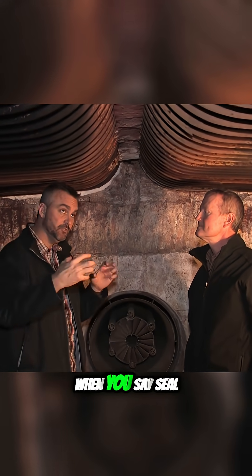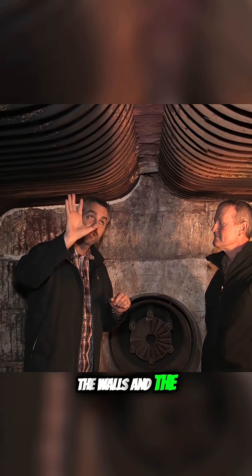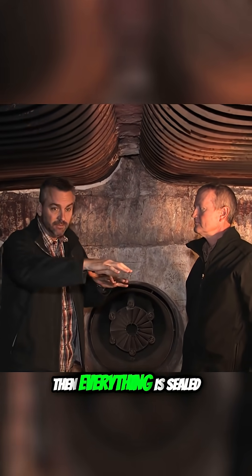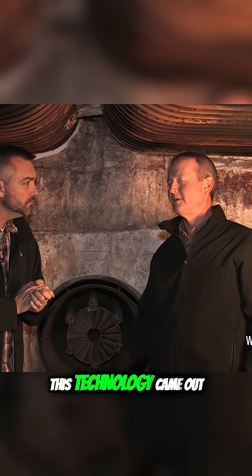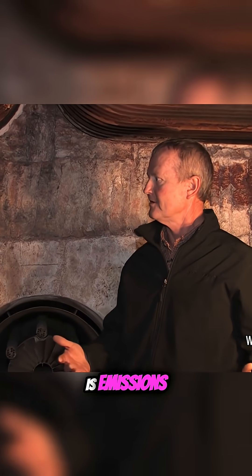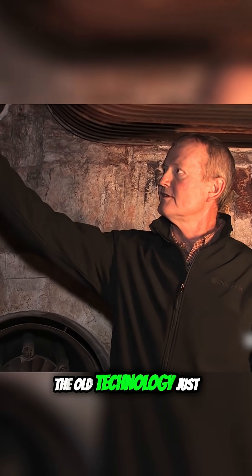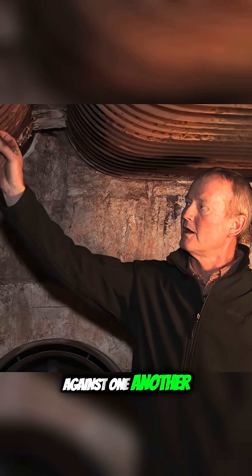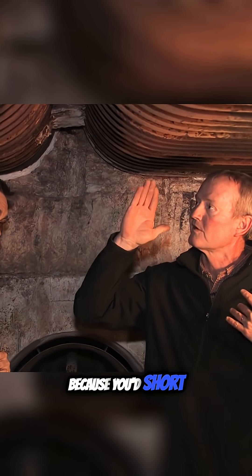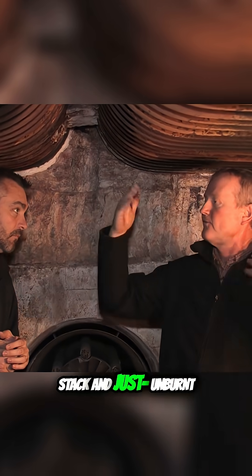Let's talk a little bit about when you say seal, because when you're looking at the walls and the tubes inside what you call the furnace, everything is sealed tight. This technology came out 30 years ago, and everybody has gone to it now, and the reason being is emissions. The old technology just had these tubes butted against one another, so you always had gaps in them, and you would create CO because you'd short-circuit between here and the stack with unburnt gases going out the stack, creating CO.